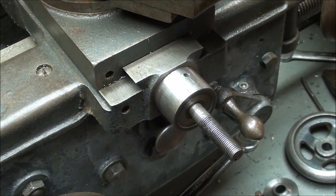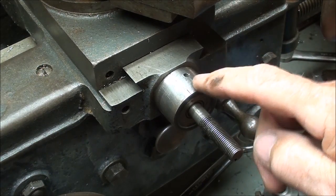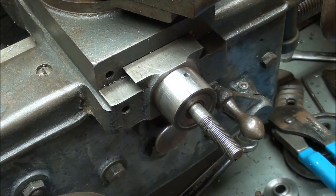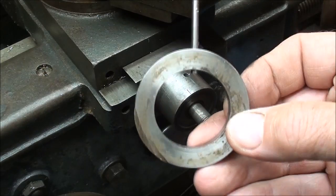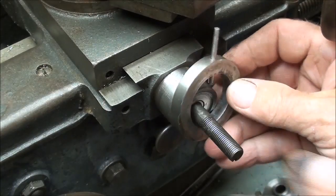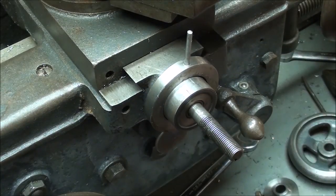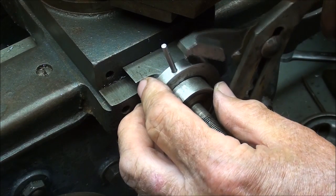Do not just put pliers on there to get this off, because it will be tight. On that other machine, if you recall, there was a hex on it, which is much friendlier when you disassemble it. In order to loosen this up, I took a bushing that I had — which was the right ID — and drilled an eighth-inch hole in there; in other words, I made a bit of a spanner. This pin will go into the hole — it's just a blind hole, not threaded — then you can put your vise grip on here and it will loosen up quite readily.